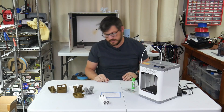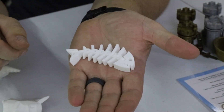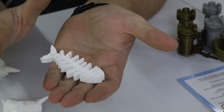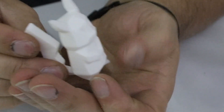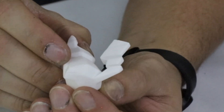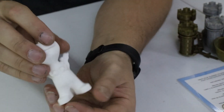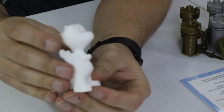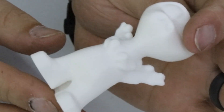I started with just the white filament, did a simple cube — came out great. Did a Flexi Fossil Fish — the only issue was being a little far from the bed, but otherwise printed very well. Then a Pikachu in their filament — quality is very good, no signs of ringing, just one minor under-extrusion blip. Then I did a dragon from the SD card with a 0.1mm layer height. Incredibly smooth, looks extremely good.